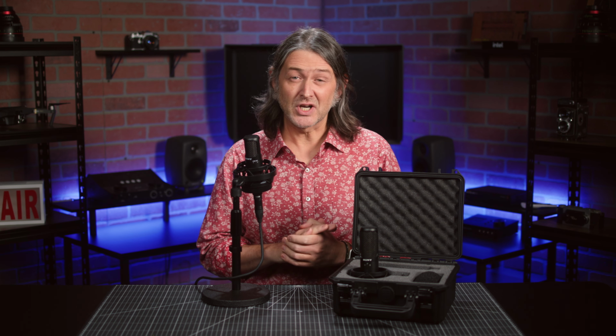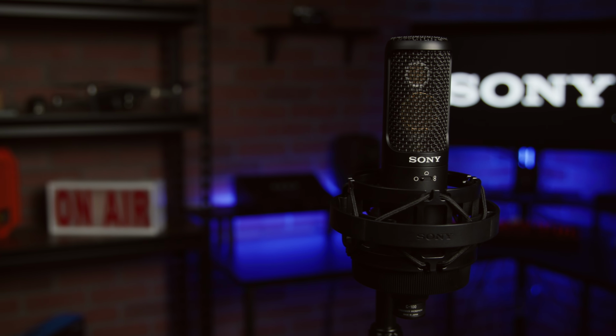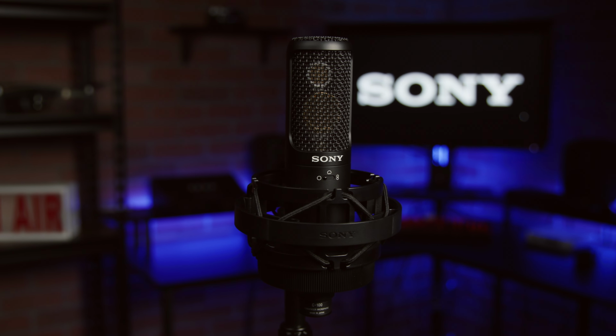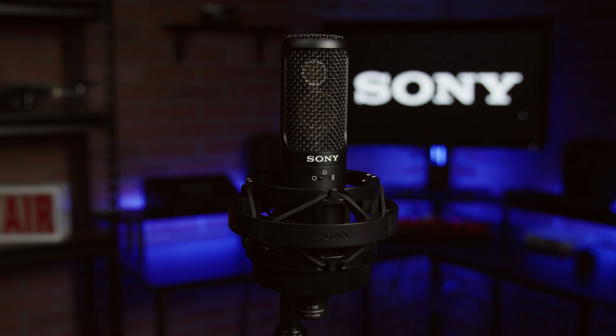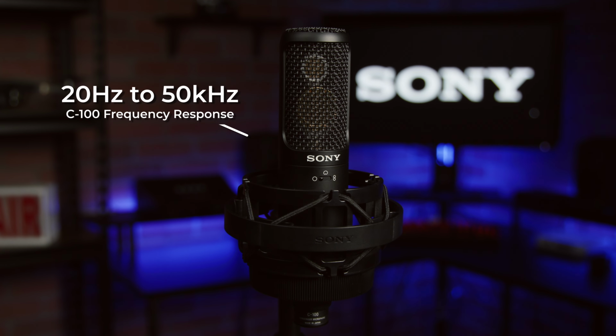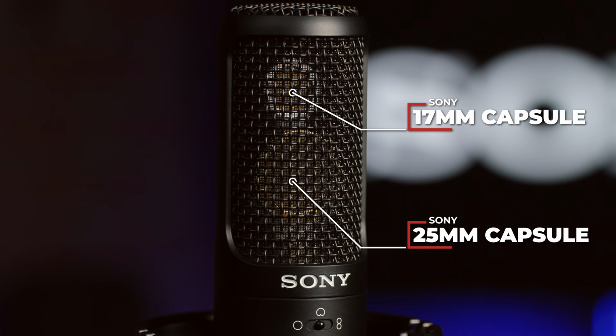Both of these mics share the same dual-diaphragm 25mm capsule. In the C-80, it delivers a frequency response of 20Hz to 20kHz, and in the C-100, this capsule is paired in a two-way design with a smaller 17mm capsule. When combined, these capsules give the C-100 a frequency response of 20Hz to 50kHz, with the 25mm capsule extending up to 25kHz and the 17mm capsule going from there all the way up to 50kHz,